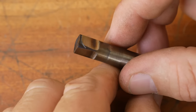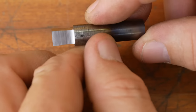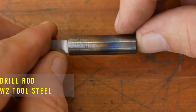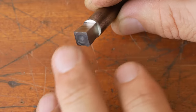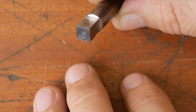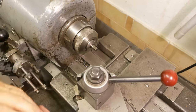I made a couple of mistakes on it and I think I over-tempered it — it's probably softened enough to be unusable. Rather than try and recover that one, I just started again and made another one. It's designed to cut a slightly oversized 7mm square. It's made of silver steel, hardened and just lightly tempered back. The last operation I need to do before I can use it is put a little more of a dish in the end here. That gives a little bit more primary relief and should make it cut better. Let's chuck this up on a collet.